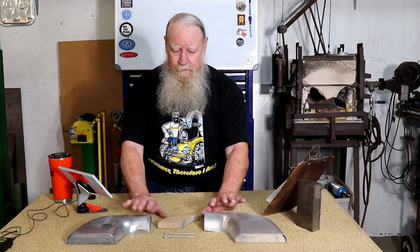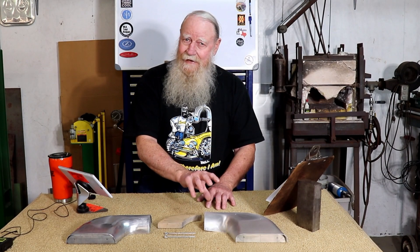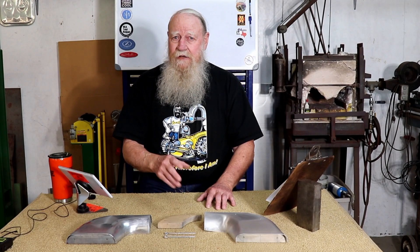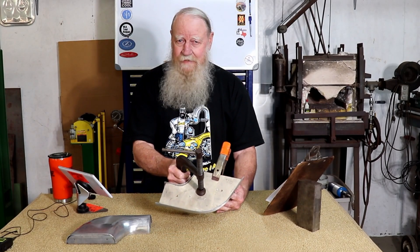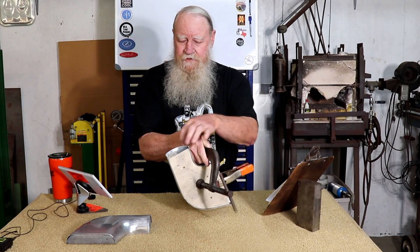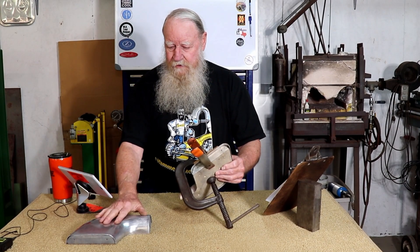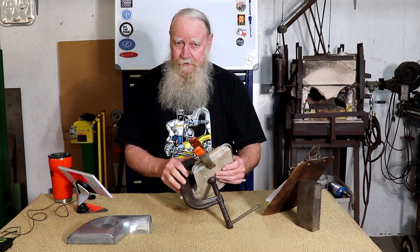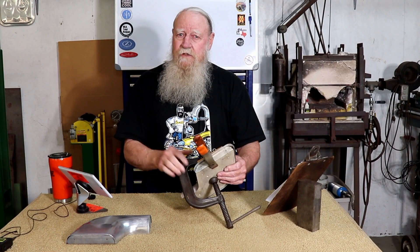I can cut the bottom portion of both pieces to get an equal amount on both sides so I can make a perfect three-inch at the ends of both pieces. I'm sure you've watched Ron's third and final episode where he showed how he clamped the pieces together to scribe and start welding. I'm going to clamp them together the same way so I can scribe the bottom portion and both ends, then do the same to my top portion and start fitting them together.